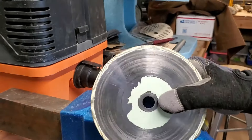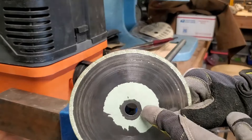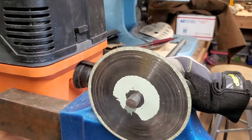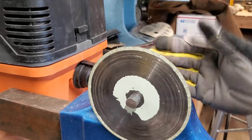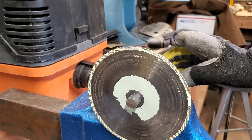What we're going to do now is take the used blades back into the shop and do a little bit of work on them, then come back to the microscope and look at our top-down view. Here's how we're going to do this: we are going to be sharpening this right here in my vise. I have a five-eighths steel rod — the arbor hole for my saw blade is five-eighths, so it fits on there perfectly. I recommend you do this on an immovable object such as this. You could also take a rod and clamp it to a workbench. Do not do this in your saw — you do not want to be applying that kind of side load to the arbor shaft in your saw. Take your blades off when you do this.